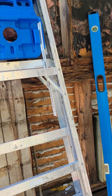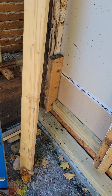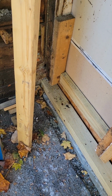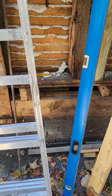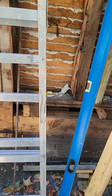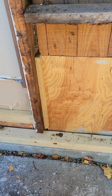So I got a lot of work to do, and this winter is going to be very, very busy for me. You can't just sister right at the base. A lot of times the rot will go higher. So like on this one, I don't know how good this wood is. So I'm gonna cut out those sisters that are already there and rebuild.